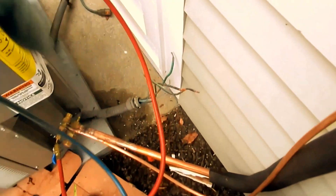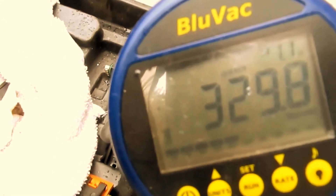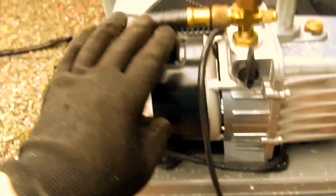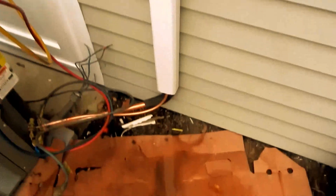Alright guys — I don't know if you can see my blue hoses here, but that gasket's all mucked up on my hoses, so that's where I'm losing my pressure at. You can see it — I need a new gasket. 329 microns — that's good. I pulled it with my 570 on the 3/8 line because I had plenty of time and other stuff to do. I got this in a downspout, so it basically looks like a rain gutter coming down — covers up nice.